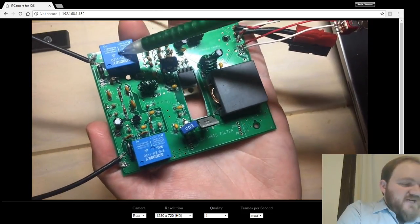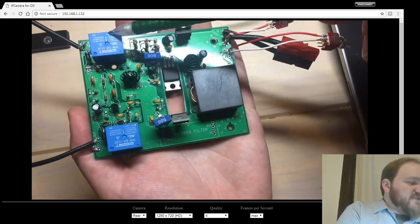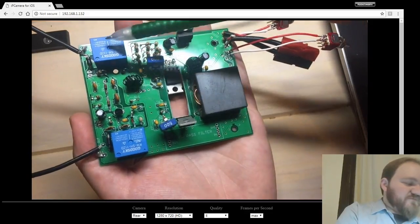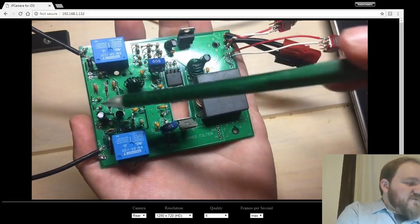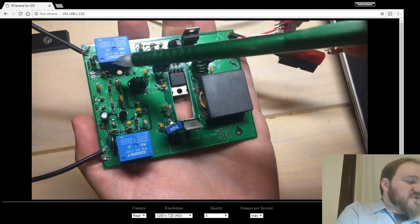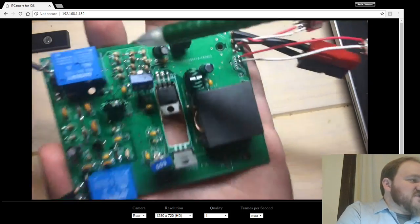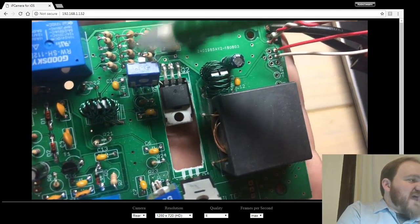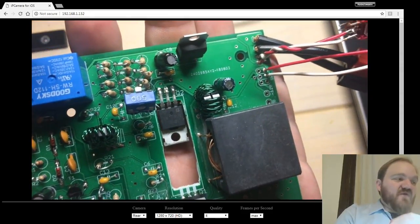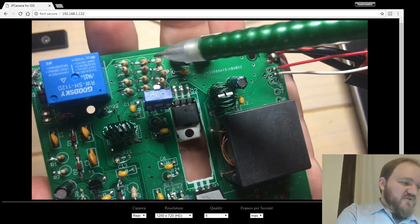It goes through this bypass relay, and if there's no power provided, then the signal is going to come right through this relay, out the other relay, and out to the output with no amplification. If I have power, this part of the PCB is a little RF sensing circuit, so when it sees RF, it'll switch both relays on. That'll send signal through this section of resistors, which is just a little 3 dB pad, but I didn't have enough high power resistors to do the actual padding from 5 watts down to like 2 watts. So this gives you the option to do a bunch of half watt resistors in parallel.